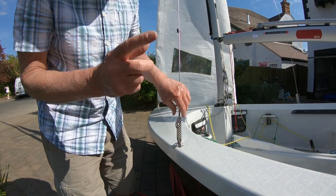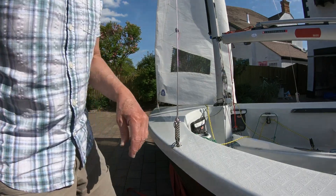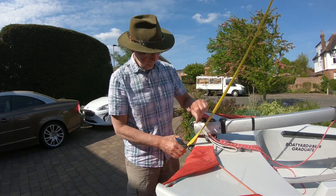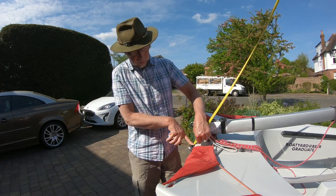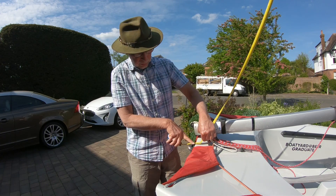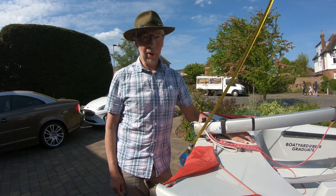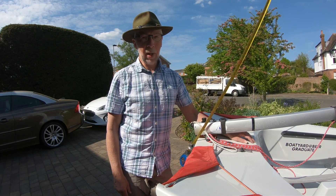There's not much of a distance here, but it has a big effect at the back and on the mast rake, so let's put the rig tension back on again. The rig is more upright — let's see what that measurement is now. And it's 247. That's a whole inch difference — that's amazing, I didn't think it'd be that much. An alternative way of measuring your mast rake is to hang a weight off the main halyard and measure the distance back from the mast.